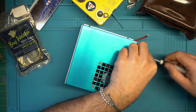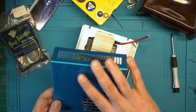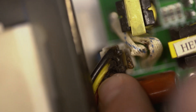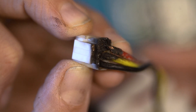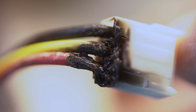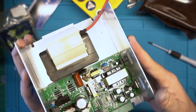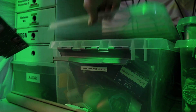Now let's get over to the bench and look inside the PSU. You can clearly see the issue here. I don't know the reason yet why this connection failed, but you can see how the arc ate through the insulation of the flyback transformer. I'm not sure whether this was caused by a failing power supply or a faulty laser tube — a failed laser tube could change in resistance, causing arcing anywhere else in the machine. But for now, I'm sticking with the idea of a power supply failure.